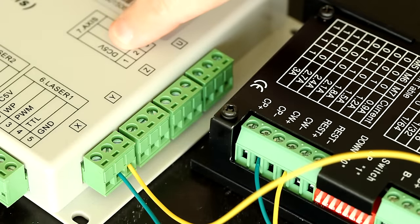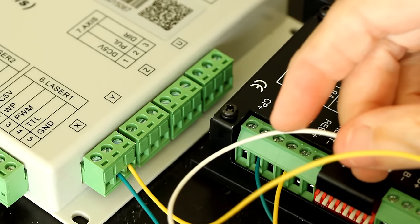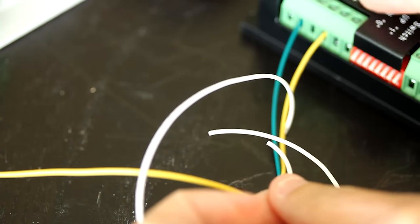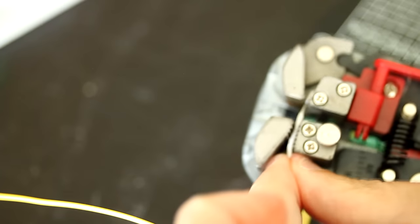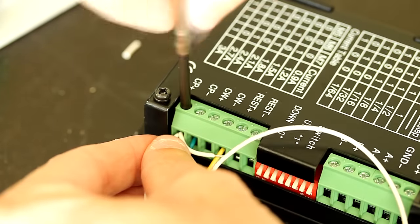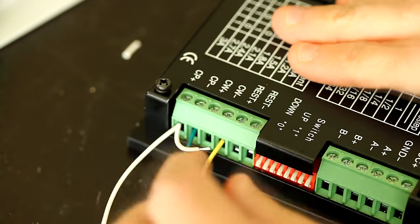Now we're going to connect the 5-volt terminal to both Cp-plus and Cw-plus. I'm going to use a white wire for the digital side of power. Because I'm connecting 5 volts to both Cw-plus and Cp-plus, I'll cut a small jumper wire to connect on the driver to jump from Cp-plus to Cw-plus. One side will be a little longer since I'll attach it to the other wire, forming a U-shape. I'll start with Cp-plus, then take the jumper and put it to Cw-plus.